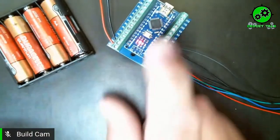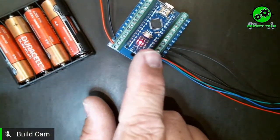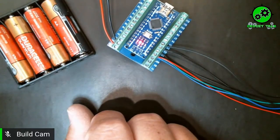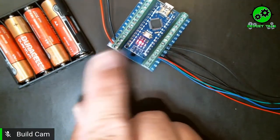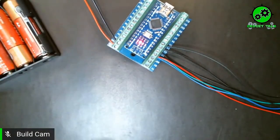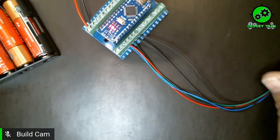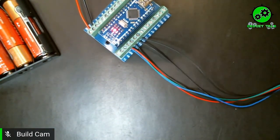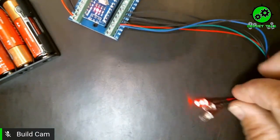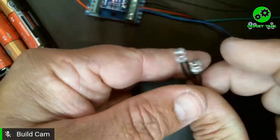The way I made this, I didn't put an on/off button because I'm imagining when you build this for the cache, you're going to have cachers bring batteries. Once the batteries are in, it's going to run the program. I'll show you how to add a delay so they know when the sequence starts over again. Could you run this off a nine volt? You could — these boards can take 5 volts all the way up to 12 volts. I run 12 volt on several of them, but I think double-A's are the best for power usage.